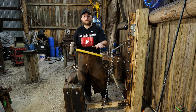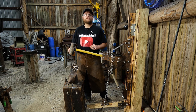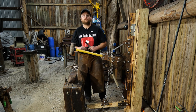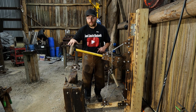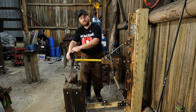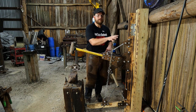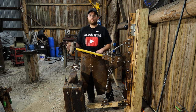For those of you who have purchased these hammers, I thank you - you already know most of these measurements. The dimension we're shooting for is 12 inches of clearance - 12 inches of throw between the face of the anvil and the hammerhead. If your hammer is down and you've got like six inches of hammer throw, that is not enough. You need to adjust and take out some links from your spring, make sure you've got proper spring tension, and take out some adjustment links to get it more proper.